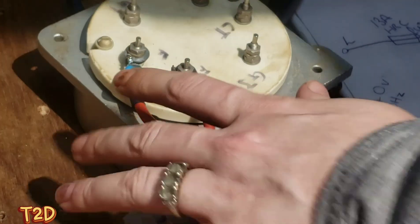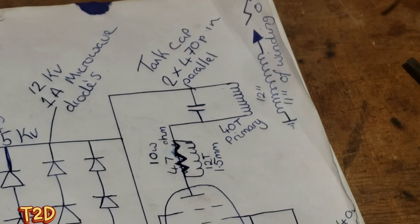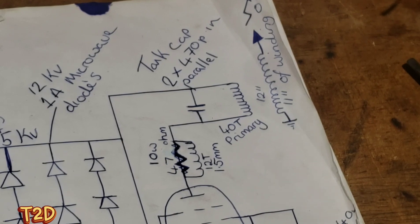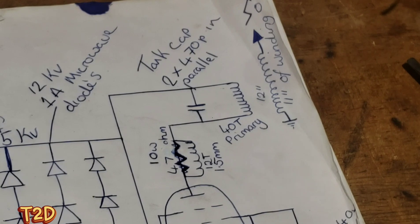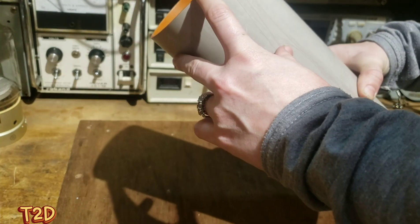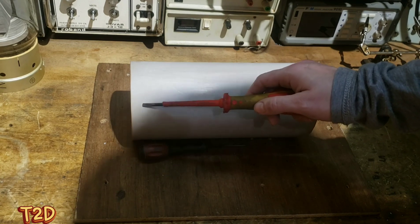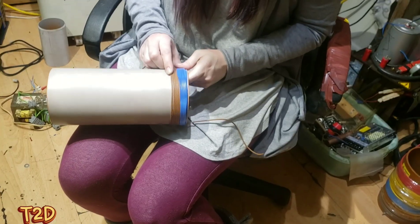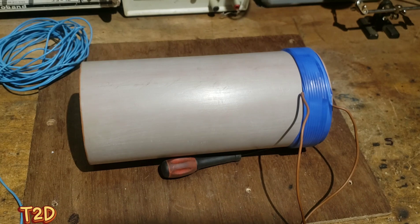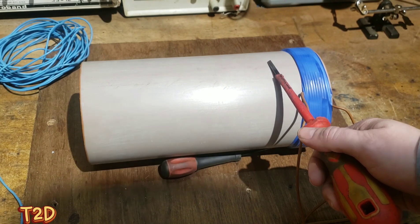We put in the capacitor on the filament, getting it as close as possible. The next thing is our primary coil, which consists of 40 turns of 1.5 millimeter standard wire. We also need to wind our feedback, which consists of 12 turns of the same gauge wire. The form for this will be 110 millimeter diameter waste pipe. I'm starting by winding my feedback coil, leaving a 10 to 15 millimeter gap and winding 12 turns, then leaving a gap of 10 to 12 millimeters before winding the primary in the same direction.